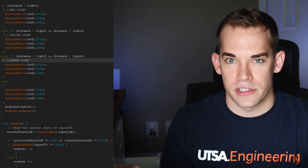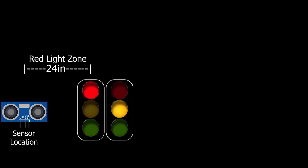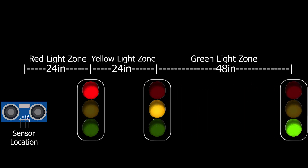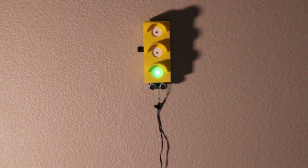It's pretty easy to understand: the furthest away is a green light, closer is yellow, and closest — where you're supposed to stop — is red. I made the red light distance a variable in the code which you can adjust with the rotary encoder on the side. The yellow and green lights are based on the distance of the red light. For example, if I adjust the red light to 24 inches, the yellow is 24 inches past the red, and the green is another 48 inches past yellow. Anything less than the threshold gives a red light, and anything six feet past the threshold gives no light.